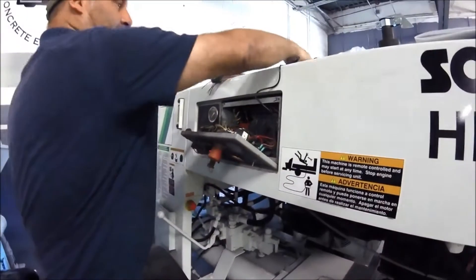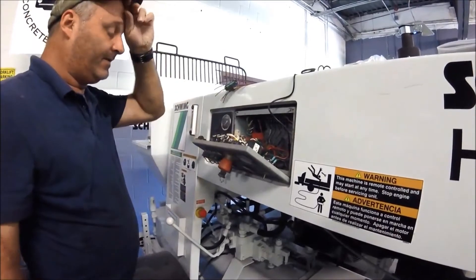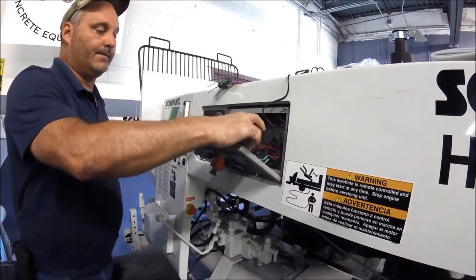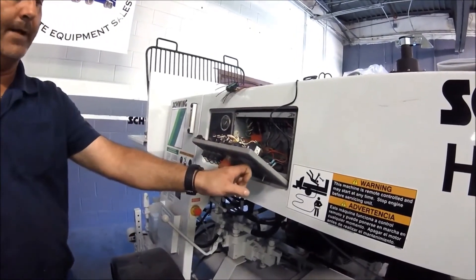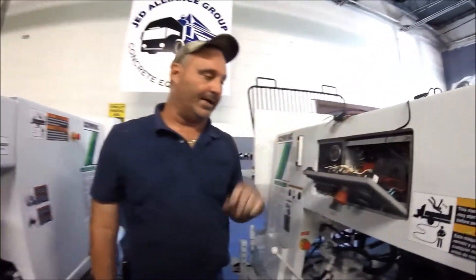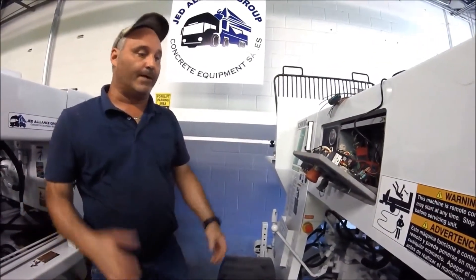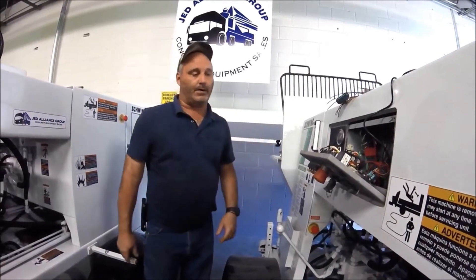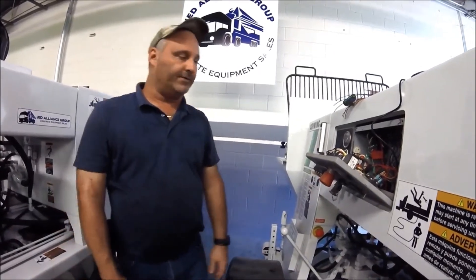So I drill the three holes at the bottom, run the wire through, loop it around, zip tie it nice. On the time meter it's already going to be grounded, so you don't have to put an inline fuse in it. It's best to run it on the machine itself instead of running power all the way to the battery and the ground all the way to the battery, because then you have to use an extra part. If you use the machine that's already got fusible link, then it's a little bit easier — it'll save you a little money.